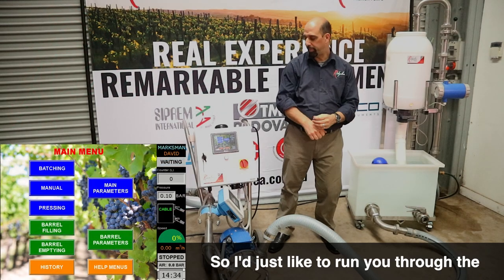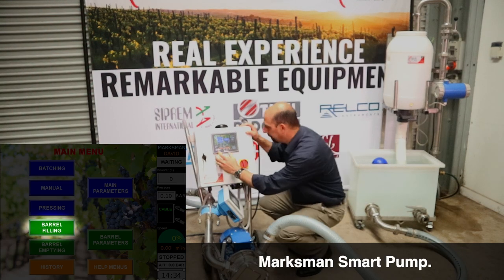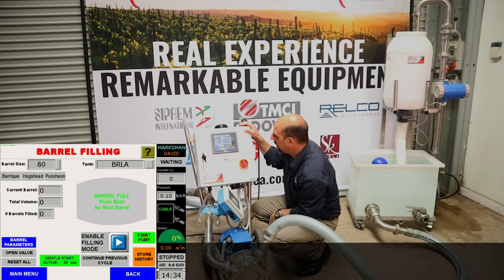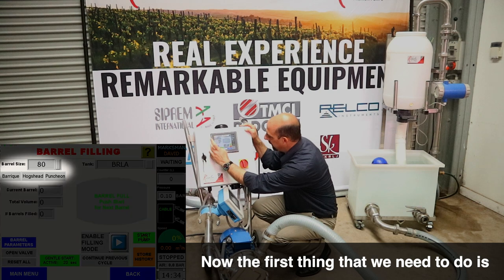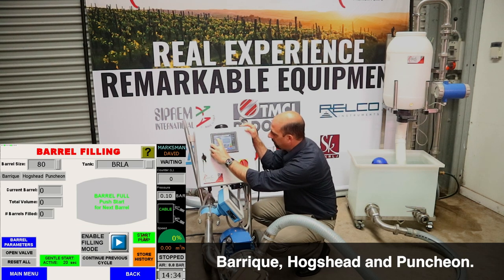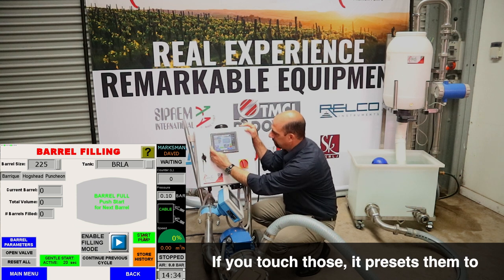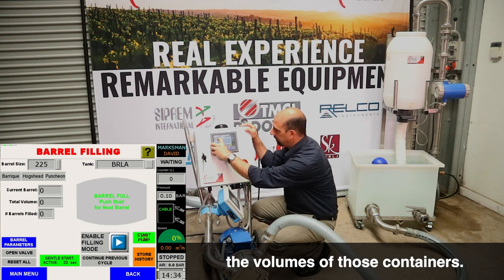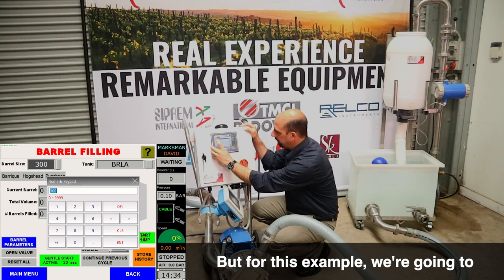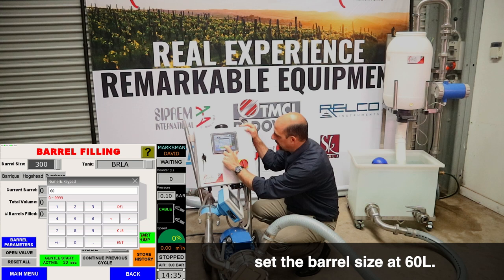I'd just like to run you through the barrel filling features of the Marksman pump. So we'll go into the barrel filling screen. Now the first thing that we need to do is set the barrel size. Up in the top corner you can see barrique, hogshead and puncheon. If you touch those, it presets them to the volumes of those containers. But for this example, we're going to set the barrel size at 60 litres.